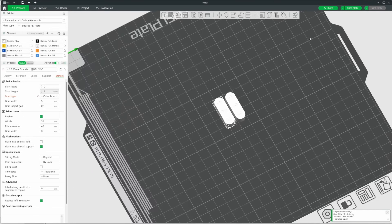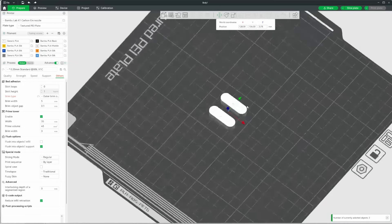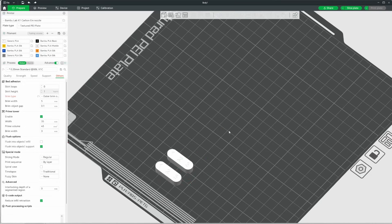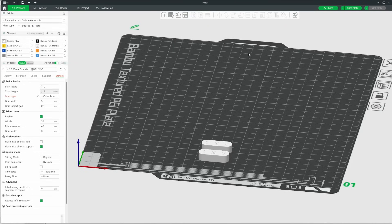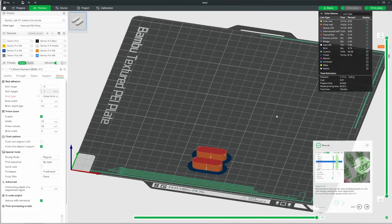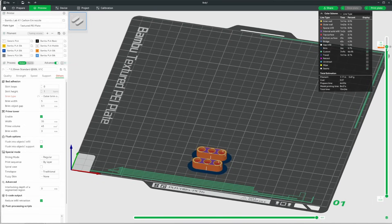I'll auto arrange and add a little bit of spacing between these, then move them toward the front of the build plate — this makes it a lot easier to access during the pause. If it was right at the back and you're trying to put the magnet in it's quite difficult. Bring it to the front as much as you can, slice the plate one more time, and this would be ready to go. It's going to pause at that point, we drop our magnets in, check the best tolerance, and then resume for those final two layers.